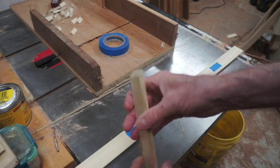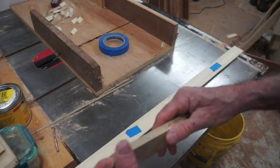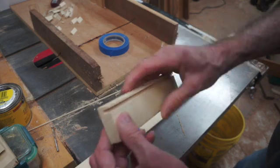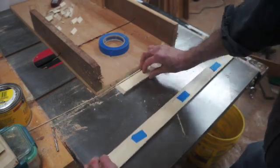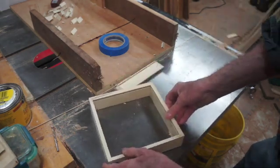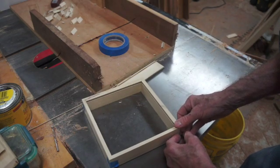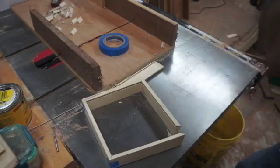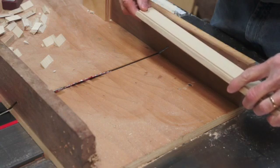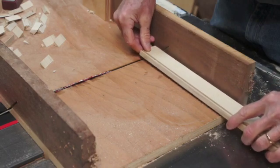These will be prepared as kits and my students will have the opportunity to take part in the assembly. Each of these pieces has a mitered edge that I'm cutting on the table saw — I'm going to show you how to do that. The way they assemble is like this. Tape holds everything together until the glue is dried and then little brad nails can be placed in the corners. If you're an experienced box maker what I'm going to do next will be easy for you. If you're not an experienced box maker you may want to check out my videos or my books.